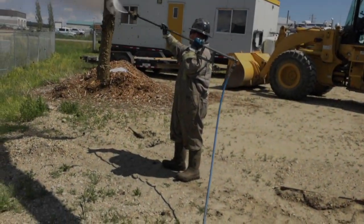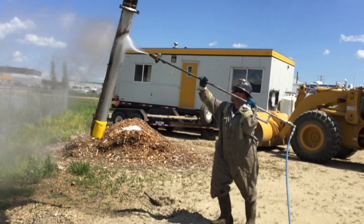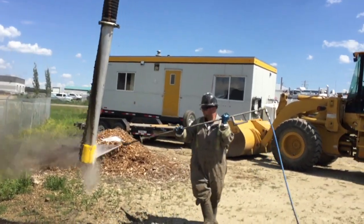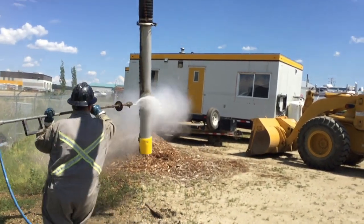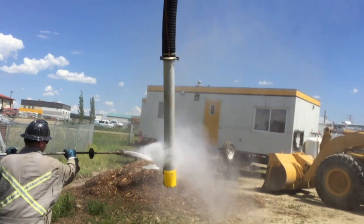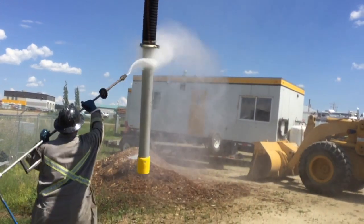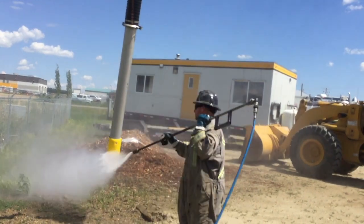With the digging now finished, the operator is moving on to cleaning his dig tube so he can stow it and move on to the dump site. As you can see, the wash wand works by spinning very quickly with a powerful jet of water — this is how it digs. By spinning quickly like this, if it ever contacts an underground utility, it is only in contact with it for a very short amount of time, thereby minimizing the risk of damage.